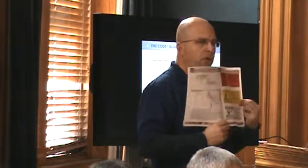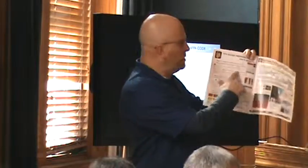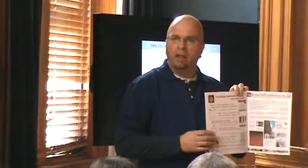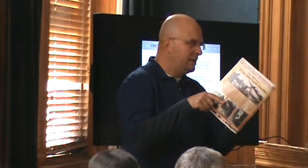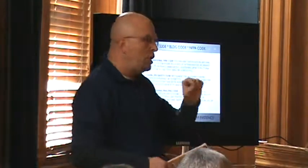These are the tags used in Seattle. When you get there and there's a fire escape problem, Seattle wants 19-by-11 tags. There's a red one and a yellow one — it's very clear for a fireman: a fire escape is out of service, so it's color-coded. But also when they pass, they have a white one with all the names on it, including who fixed it, their phone numbers, and who's the engineer. A lot of the information is all on the tag.